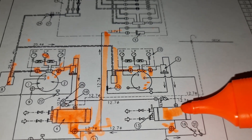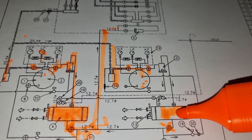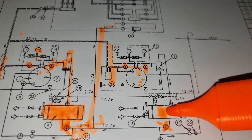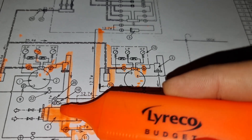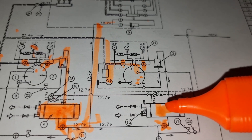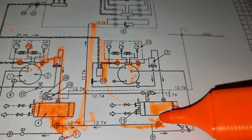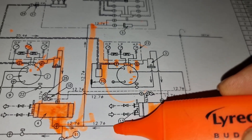We will monitor on the sight glass the level of refrigerant on the condenser. If it is going up, we can be sure that we have transferred all the refrigerant from the number one condenser to our number two condenser. In this way we are sure that we have a good level of refrigerant on this side before we close the connecting valve. And finally we can open the outlet service valve of condenser number two.